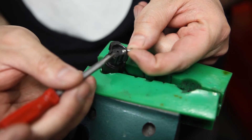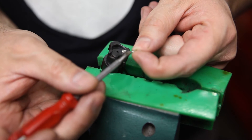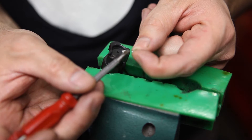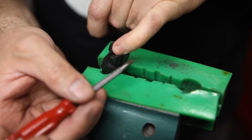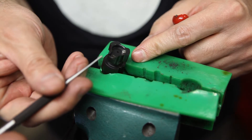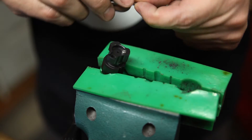The detent has a little tail on it to keep it inside the spring. If you have an older version of the bolt, this was just a little ball bearing, so you're going to be a little bit more careful because that ball bearing will take off in orbit. There is a small spring inside that hole — the easiest way to grab that is to get your 1/16" punch, stick it in the hole there, and lift it out and set it aside.